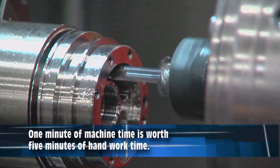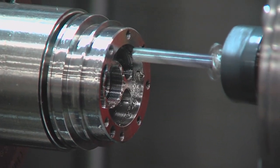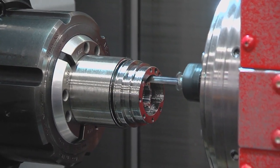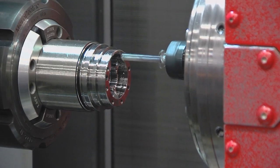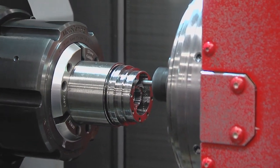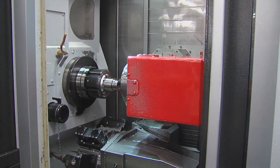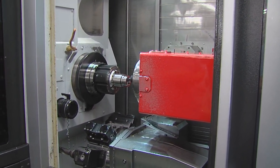This is a roughing op — it doesn't look like much, but that's about seven thousandths per revolution on that drill, which is extremely heavy in this material. But it just runs and runs — the tooling is excellent. The high-pressure coolant is what makes this operation possible. That drill has holes all the way through it and we pump 2,000 PSI coolant down the center to disperse the chips, so we don't have to pull out to break or remove chips — we just plunge all the way in one pass. These end mills are relieved all the way back behind the cutting flutes so we can go down in there and cut without dragging on the wall — otherwise you get chatter, poor finish, and poor strength. These are like Ferraris, Porsches, and Bugattis. For the parts we do, there's no other way to make a profit than with the best tools and equipment money can buy.